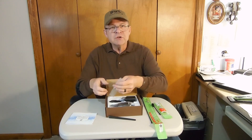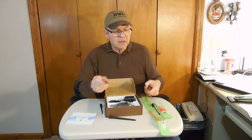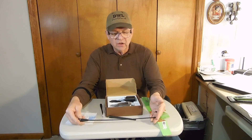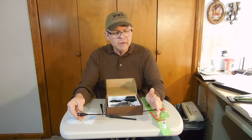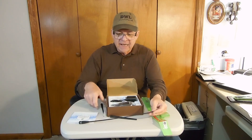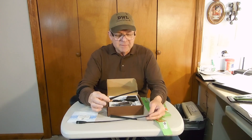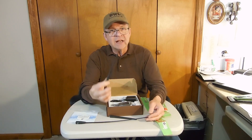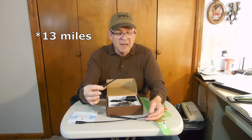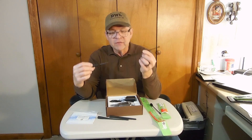I'm interested in going back up with a Nagoya 771 and seeing what will happen. When you take your ham license, they'll tell you that these stock antennas are not very good. This slender one is at least a little bit better, but I'm not going to use it with this UV-82. I have an NA-771 Nagoya that I purchased for it — you can see it's a little longer. These will improve your reception and your transmission. There are times when I couldn't even open the repeater at Truman, which is about less than 20 miles away, but I was able to communicate with this antenna.